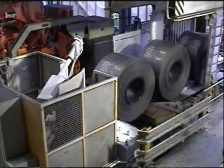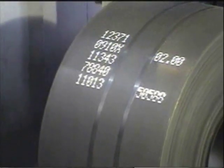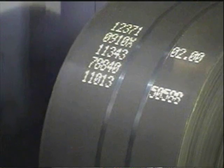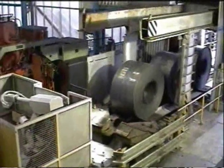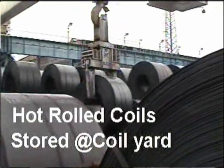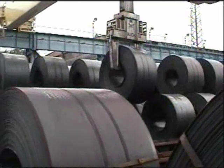These are the products that we were able to roll during the performance test: 1.5mm, 1.8mm, and 2.0mm. During the performance test, the mill has also demonstrated that it is capable of rolling 1.0mm. We also rolled checker plates during the performance test.